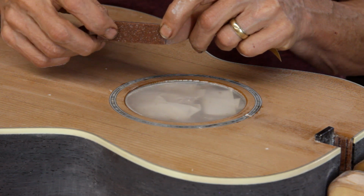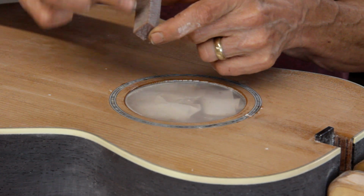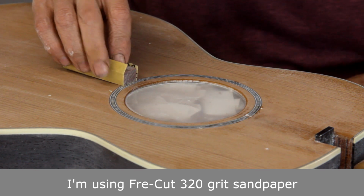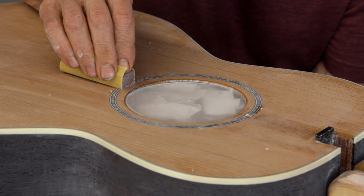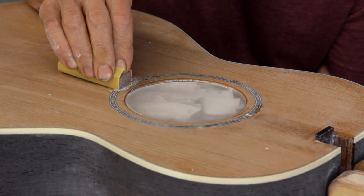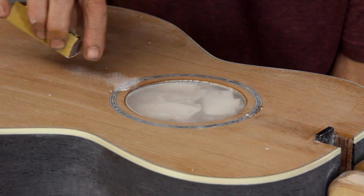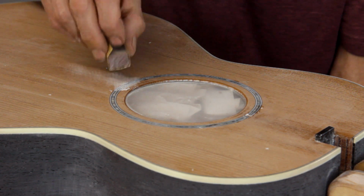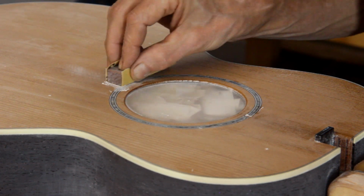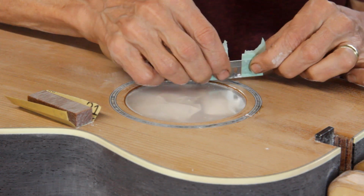On the Corian block, I'm going to use the smooth edge to back up against the sandpaper. I'm not going to use a rough edge because that's the areas that I machined. Wrap the sandpaper around it, get it as flat as possible, and holding it firmly on the surface, sand. Now, it's very easy to go through the polyester that's around the repaired area. So be very careful and change directions with your block a lot. If you need to come back with the razor blade, do so.